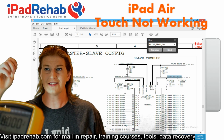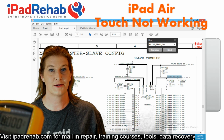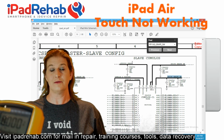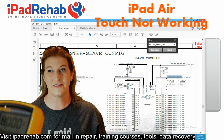All right, so we're going to check the box for power line number 1. And then that takes us to investigating power number 2, PP5V25 Grape. So we have to take off those shields to even test that line, and we'd ask the same question: is that voltage present? If not, why not? And it makes perfect sense.